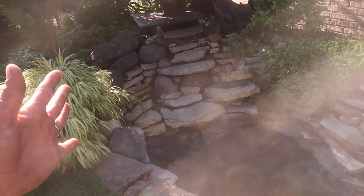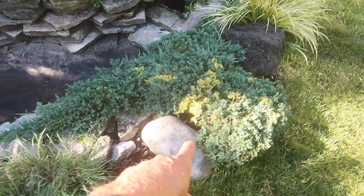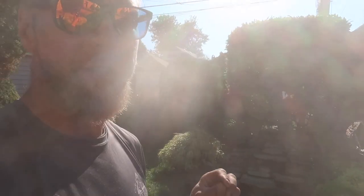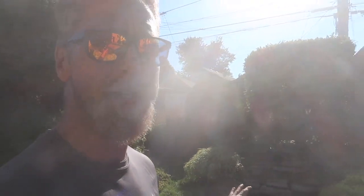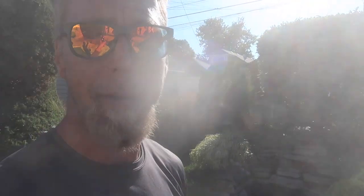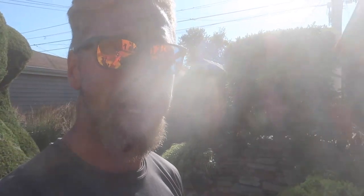What we're going to do is completely demolish everything, pull out all the flagstone. We're going to come in with granite round boulders. We're going to make the pond a little bit bigger, kind of sweep it out. One of the motivating factors is also to make this pond deeper. The customer currently takes the fish inside for winter because the current depth is really only about 14 inches of water depth. Here in the Midwest, that's borderline not deep enough to house fish over the winter, so we're going to make it so he can keep his fish outside, reducing the amount of work he has to put into this.